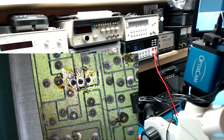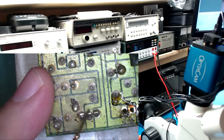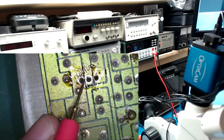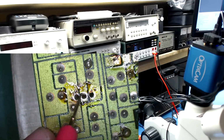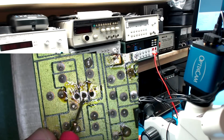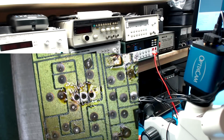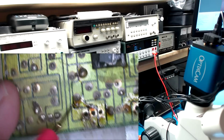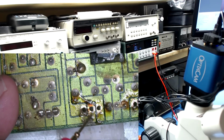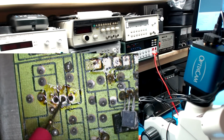Okay, I've taken the component out, and this middle pin and this middle pin are the rail voltages for the plus and minus 20 volts, and I do not have a connection to the minus 20 volts of the switching power supply. I think it's due to this via crap biting us in the ass again, because this supplies that circuit with the negative portion of the power supply.